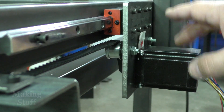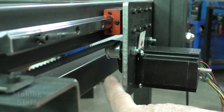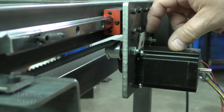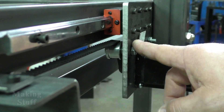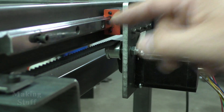I also had the same problem with the motor — the pinion gear on the motor was doing the same thing, the belt wanted to ride on the outside. So I put some shims up here on the top to kind of offset that and that has fixed the problem. More than likely these pulleys are not in square either, and that's why the belt is riding up on the edge.